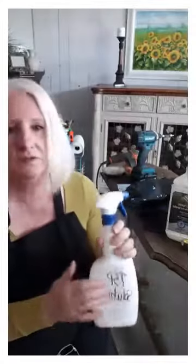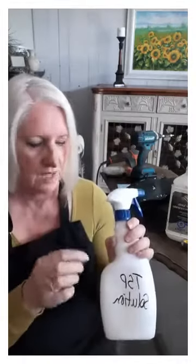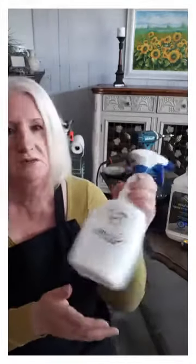First we have to clean it. I use Fusion's TSP. You put a capful in a liter of water. What I do is mix it up in a spray bottle rather than in a bucket, so I don't waste it. We're going to clean the whole piece first with TSP — that gets the grime off, old dust, old grease. As we're cleaning it, we'll find out if there's any wax spilled on it from candles. TSP won't take wax off but it will show up, and then you can take a scraper and a little mineral spirits to wipe the wax right out.